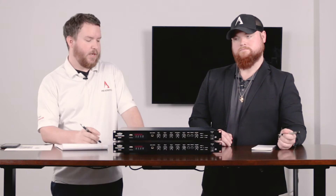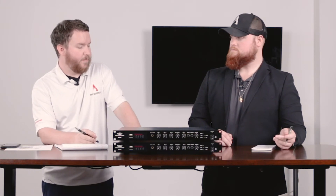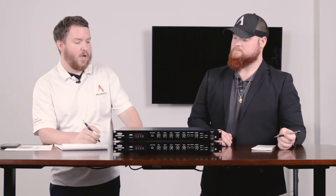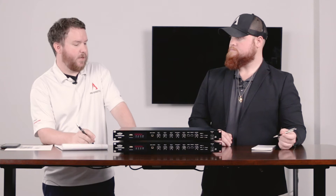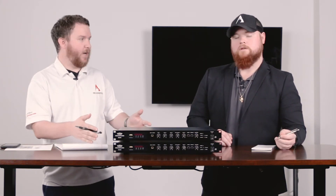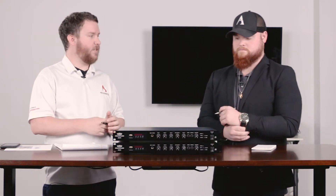With the RMA 350BT, you do have 350 watts at four ohms, so you can do a couple of 10-inch or two-way speakers with 10-inch woofers and move some decent air. We're not talking about thousand-watt amplifiers here, but these are very simple-to-use mixer amplifiers that still have decent horsepower under the hood to power a couple of speakers for a small cafetorium, auditorium, or foreground-level applications.